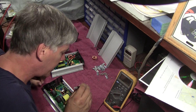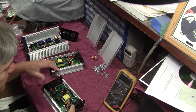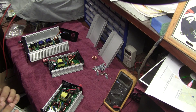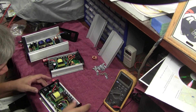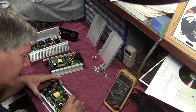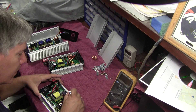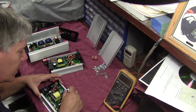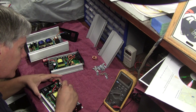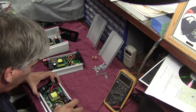There's a little thermal grease on the FETs and the insulator. There's no way I can slide this board out without ripping those insulators. I'm using an X-Acto with a busted-off blade — just be careful with it because it can still puncture the insulator. Okay, we're done.